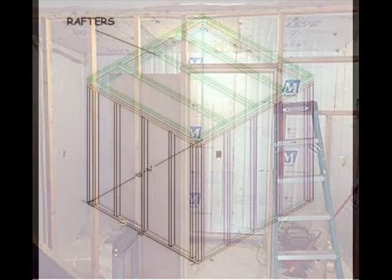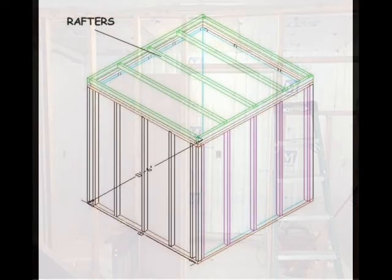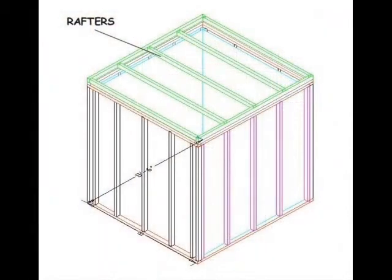This picture illustrates a simple 8-foot by 8-foot cooler with 2-inch solid insulation between the studs and on the studs. The roof of the cooler should also be insulated between the rafters and on the bottom of the rafters. Let's remove the roof rafters and examine the basic framing structure of the cooler.